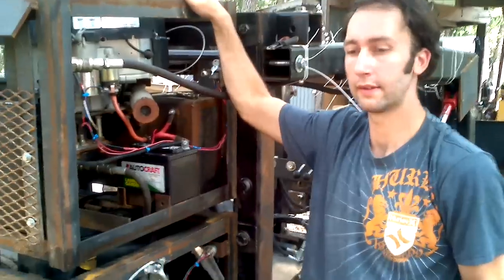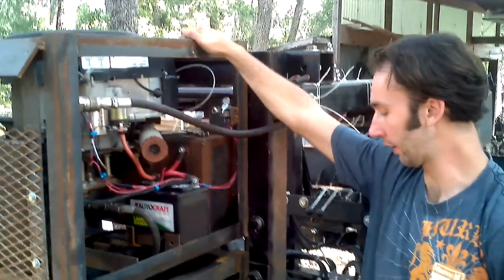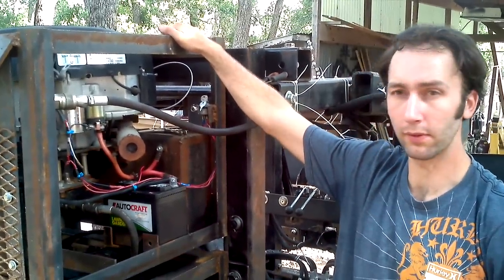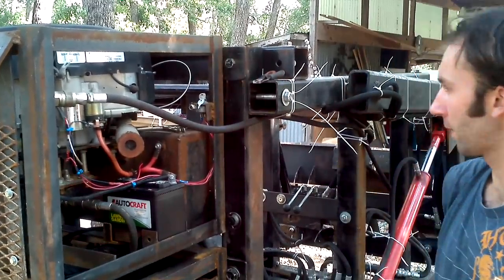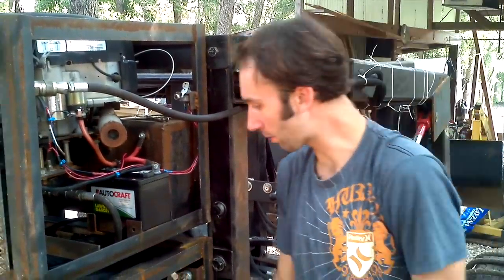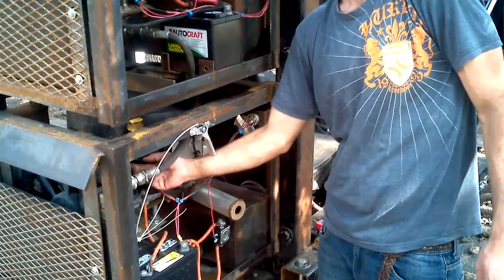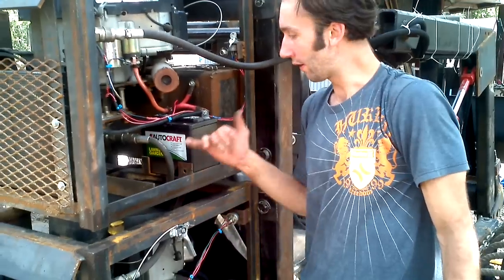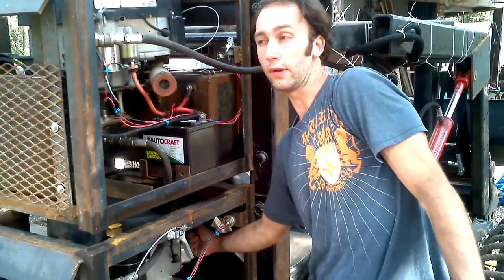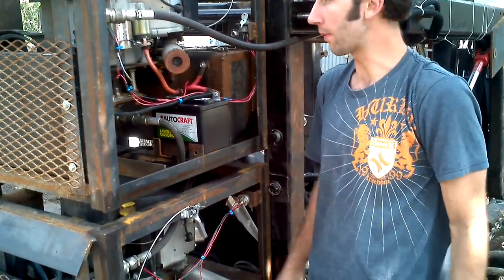Would you like to cover what you've done and why? It was hard to determine exactly what the last person had going. I knew they had some problems with burning wires and the engine wouldn't turn off. Essentially, the initial problem was the cooling fan, the fuel solenoid, and the charge wire off the regulator were all tied together. So when you shut off the ignition, the cooling fan kept the fuel solenoid energized — it kept running and kept charging.